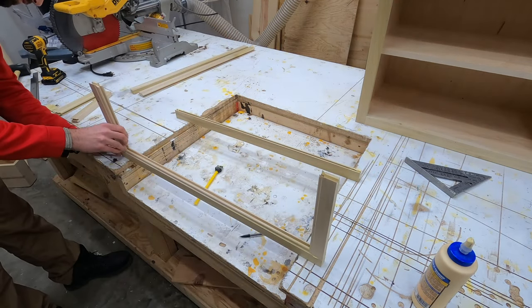The cabinet is finished but we need to figure out how to put it up on the wall, so here I'm making a simple french cleat system out of plywood. One board is cut at a 45-degree angle and glued onto the back facing downward, and then the other board cut from that 45-degree angle will be attached to the wall using screws facing upward. When the cabinet is set down on top they'll form an interlocking joint that holds the cabinet very securely on the wall.